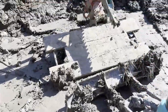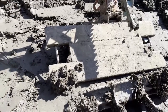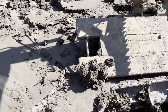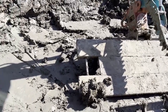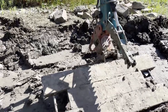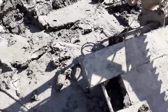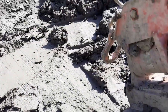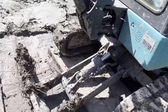And I built me these crane mats. Okay, as you can see, it's 2 long boards at the outside and 1 shorter board at the inside, with 16mm threaded rods, and stainless steel tube over it so as to protect the rods. Usually what you do is you grab it with the excavator and you hold it with the thumb, but sometimes, especially in deep mud, that just doesn't work. So what I did is I constructed this so that there is a place for a hook to grab the mat and put it from behind you to ahead of you. Okay, so that is good.